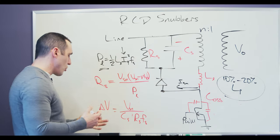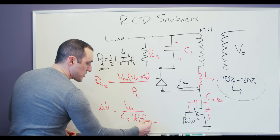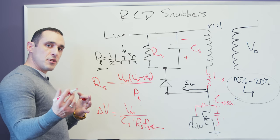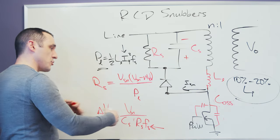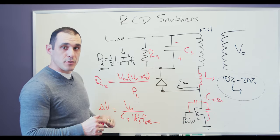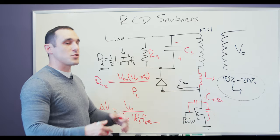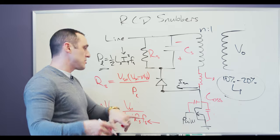Another way to control the noise without using a very large resistor is to adjust our switching frequency. As the switching frequency goes up, delta V would go down because the frequency is in the denominator. However, as the switching frequency goes up, the edge rate for turn-on and turn-off time also has to go down to accommodate fast edges. That can create a problem with this diode because it needs to have very fast reverse recovery time. Eventually if those edges on the switching waveform get faster than the diode's reverse recovery time you will start to dissipate a lot of heat in the diode. You will need to swap out that diode for a much faster one — typically a Schottky rectifier diode with something on the order of nanoseconds reverse recovery time.